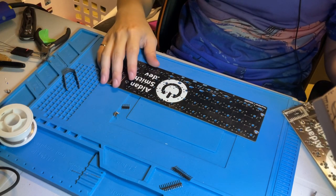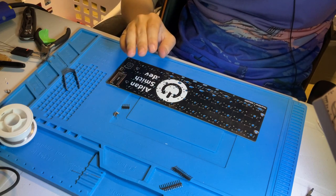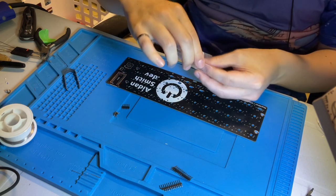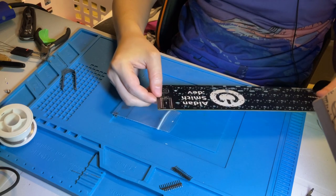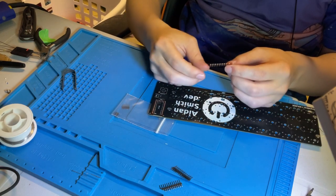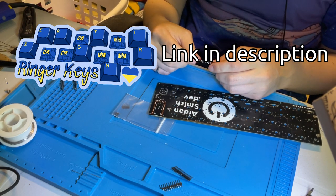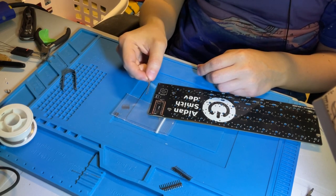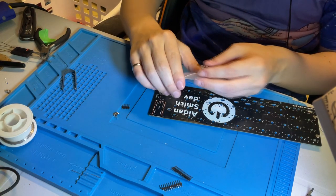With either of the boards, you have the option — not sold with the group buy — of getting some Milmax ultra-low-profile Hotswap sockets for microcontrollers, so you can Hotswap your microcontroller. You need to use a very particular type: this ultra-low-profile socket available from Ringer Keys. These are the only ones that will work — anything with a higher profile will prevent you from fitting everything in the right space and causes issues with the OLED.